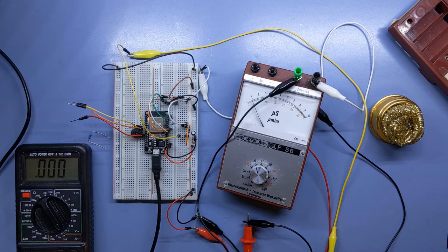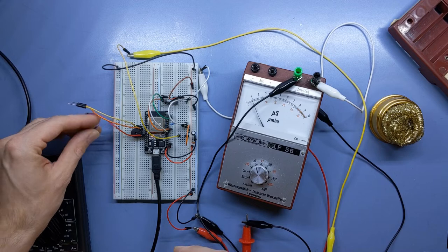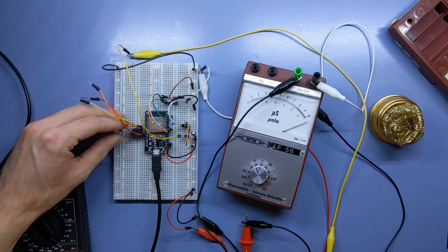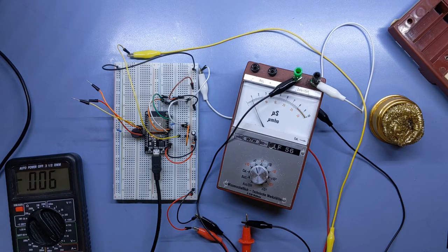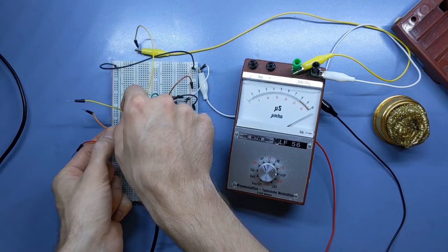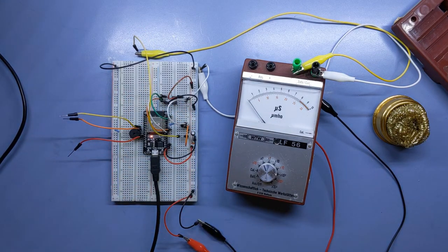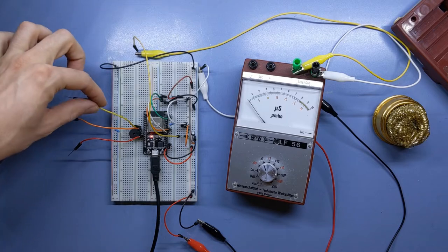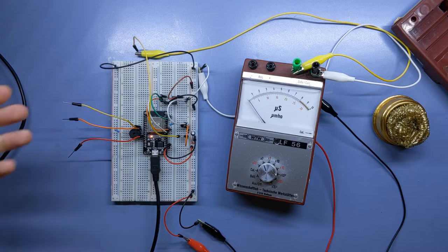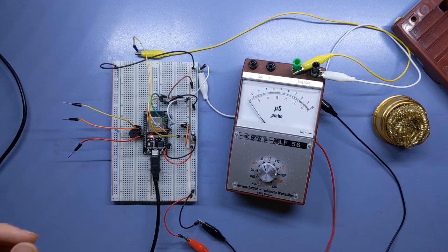Anyway, now the device beeps in partially random intervals, at least when I put this resistor back in, which I just removed to prevent it being annoying. There was a beep. And when we touch these three inputs, we can indicate seven levels of values to be displayed, which are accompanied by some beeping. Yellow is binary 1, orange is binary 2, and red is binary 4. So when we touch all three of them, it goes to 7.